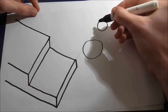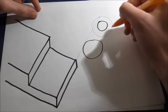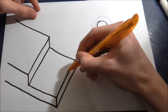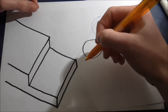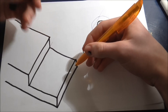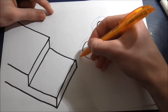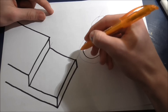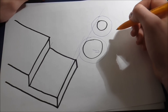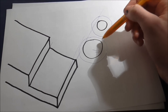Say the part's too long — I can tell the machine that the tool is smaller, and the machine will think the tool is this big, but in actual fact the tool is this big. So when it moves the tool back up to this line and brings it for a second pass it should cut off an extra bit. Likewise, if the part had come out too short, I could adjust the tool and the part should come out bigger — I'd tell the machine that the tool was bigger, and it would then come further this way because it thinks that's the cutting edge when actually that's the cutting edge. So that's one way of altering part lengths without altering the program.